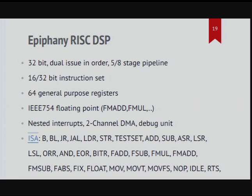If you look at the history of DSP in the 1980s, it grew up as a MAC unit, right? The first thing that came in was a multiply accumulate, and everything just kind of evolved from that. But from the 80s to the 90s, year over year, if you discount the process improvement, it got less efficient every year in a sense, if what you wanted to do was a MAC. And so we just went back and said, what we want to focus on is doing multiply accumulates. Anything that's not multiply accumulate goes out of the chip.